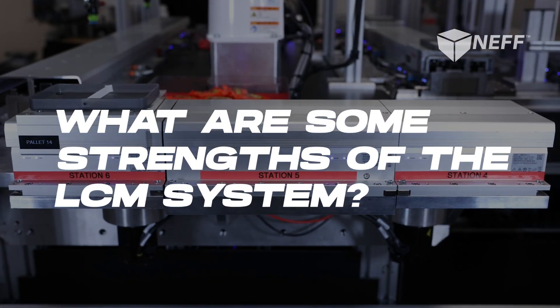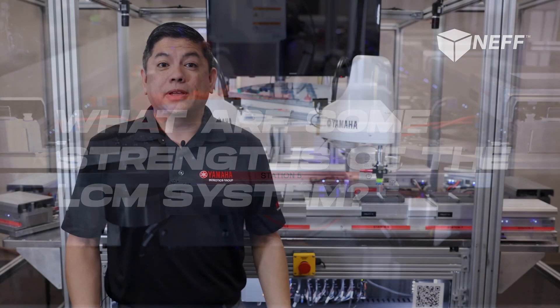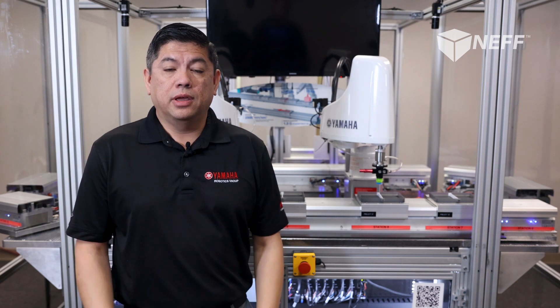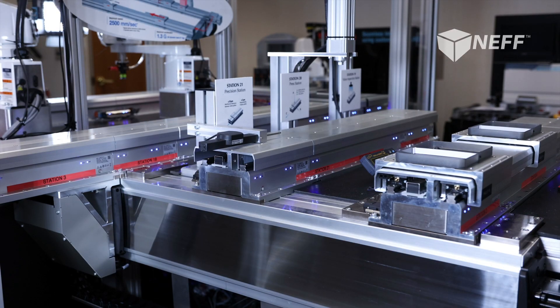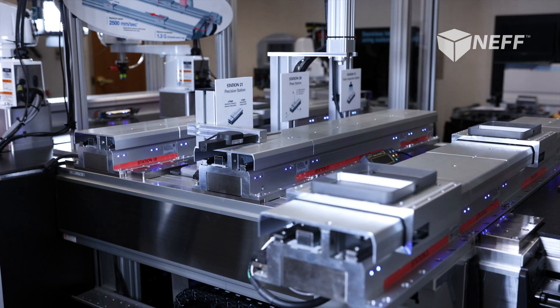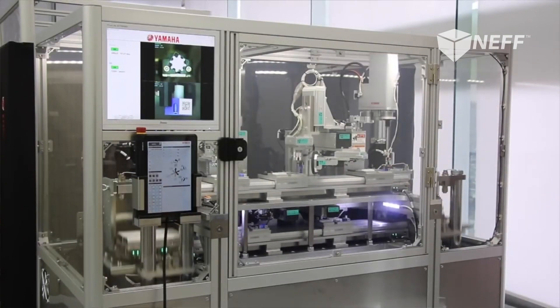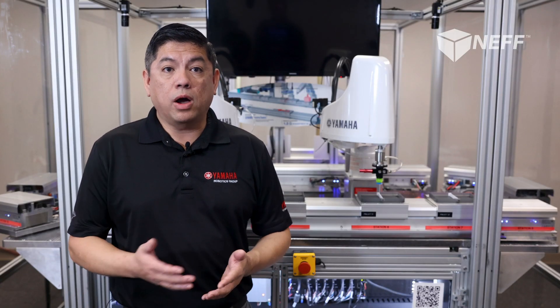Magnetism is a thing of beauty. Typically, the LCM unit is used to compact an assembly line in a straight line process. Instead of using a circular dial table layout to save floor space, you'll find it very flexible to lay out multi-layers or multi-lanes to solve your transportation problems or overcome bottleneck issues with mismatched cycle times. The LCM can be used in multi-layer double or even triple deck with an elevator transfer, or a side-by-side horizontal layout. Some even like to use the LCM like a long assembly walking beam.